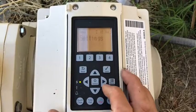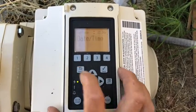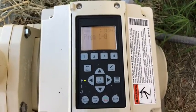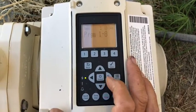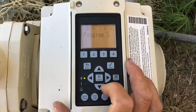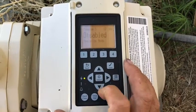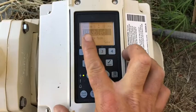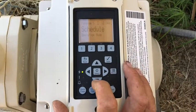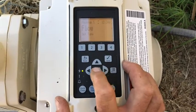Let's go back to Settings and make sure we've hit everything: time, min/max, device, alarm log. Now let's go to Programs one through eight. In the old pump this was Speeds one through eight, but because we can now choose either flow or RPM, these work differently. I like to leave programs one through four alone and program up in program five, so someone can't come over and mess with those buttons — those programs will stay no matter what. To program, we hit select; this is disabled, so we hit select again and move to Schedule.